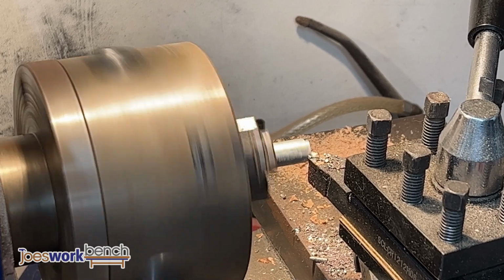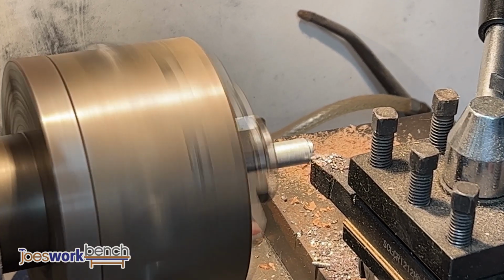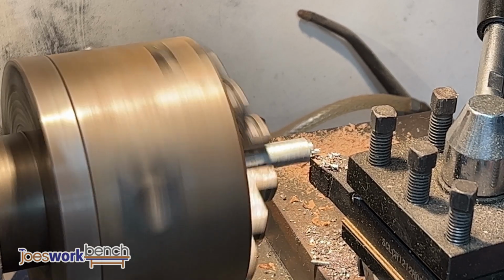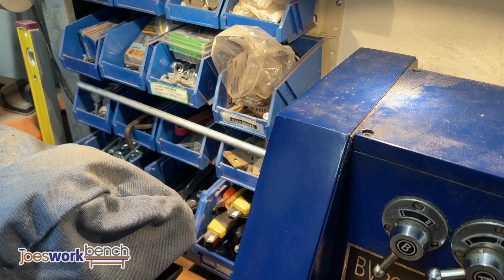Now onto the shaft that holds the paper. I tried using wood like the original, but the smaller hole in the roll meant it just wasn't strong enough. In the end, I used 10mm bar stock with a 6mm notch to hold it all in place.